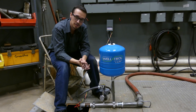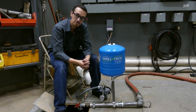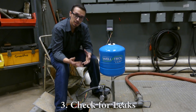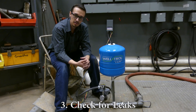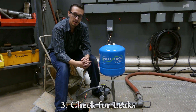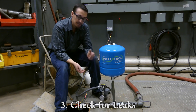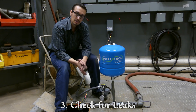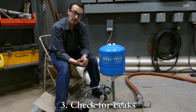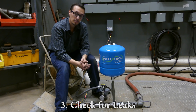Now that we've gone through and checked all those pieces of equipment, the next thing to look for if you haven't identified the issue is to inspect the system for leaks. This is definitely a common symptom when you have leaks within the system. If we had a valve right here between the pump and the pressure switch, we'd be able to close that valve with the system fully pressurized, and if we had pressure loss occurring on either end of that valve, we'd be able to isolate where the problem is.